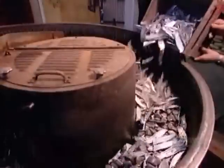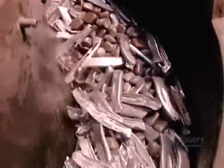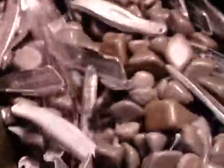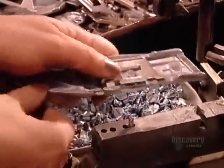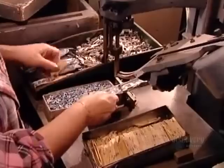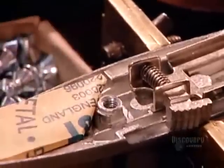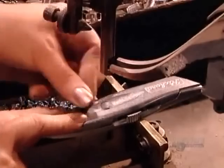This factory also produces retractable utility knives. It puts the cast aluminum handles through a machine that uses polishing stones to remove any shards of metal. Workers assemble the utility knives manually, first installing the push button that moves the blade in and out. After putting in a spare blade, they close up the handle with 1 screw.